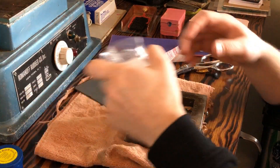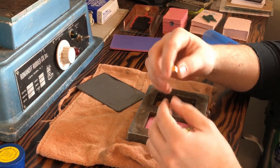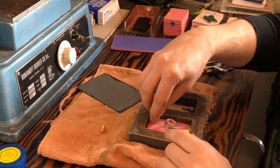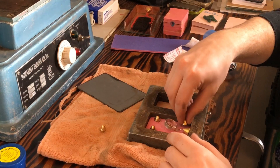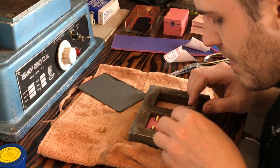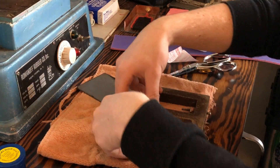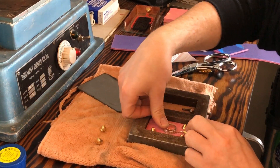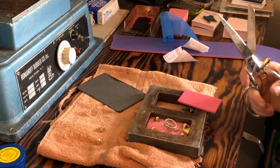Because this doesn't require any cutting, I'm going to use mold locks. Mold locks are these little punched-out brass pieces — you stick them in the corners or wherever you want, and they mold the rubber during vulcanization into a small cone that connects with the top half of the mold, keeping everything aligned properly. Either method — mold locks or cutting — works fine. I haven't had any real trouble with these; they're simpler and a little less time-consuming.